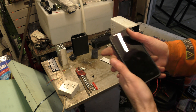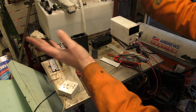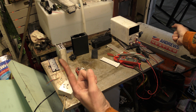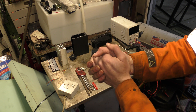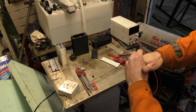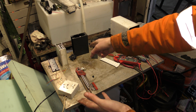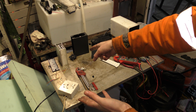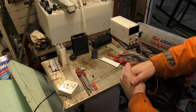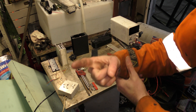There's not much point putting it back inside its shell. I'll see what I might do with it — I might put it all back together and use it somewhere, but it's dark when the lights are off so that won't work either. Anyway, it has died. You probably could replace the power supply and get it working. If nothing else, we have seen inside the Netatmo camera and how to take it apart — and it's not that hard, actually. Once you take the bottom cover off, pop the lens cap off, undo six hex screws, and it all just slides apart. I'm disappointed that it has failed, but we learned something, and that's all that really matters. Thanks for watching.